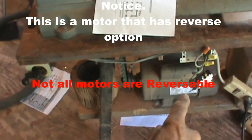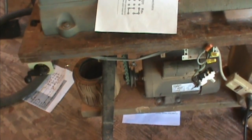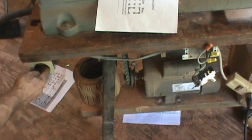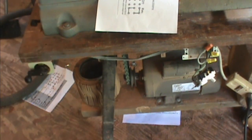So I've got my main on/off and I have the drum forward and reverse. Now as I suspected, it's wired in the opposite way, so I have to take the wire that comes from this side of the switch to this one — swap the red from this side into that side — and the whole thing will be correct.